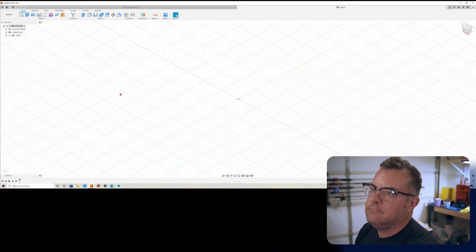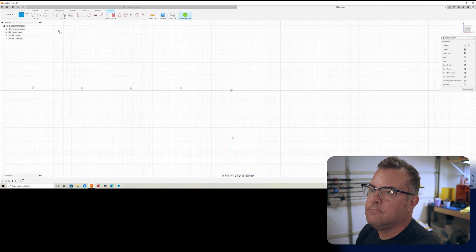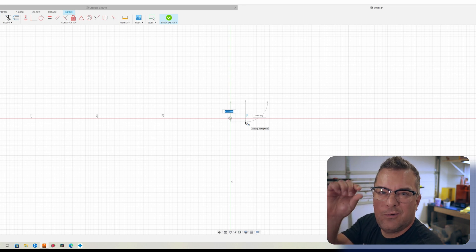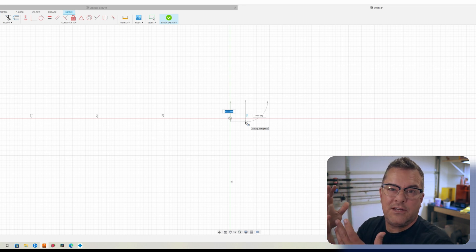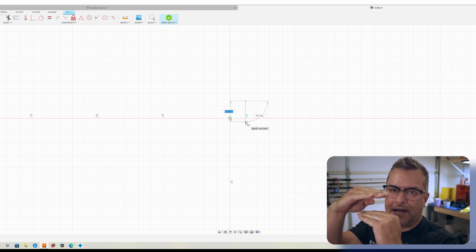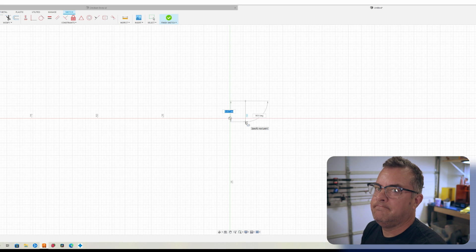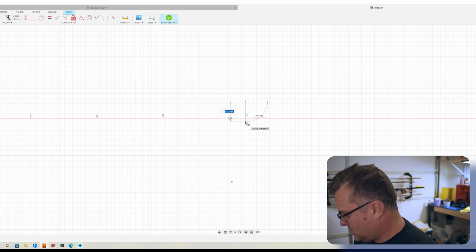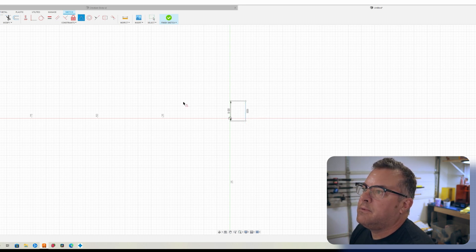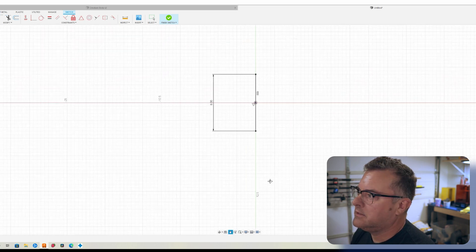Now what we want to do is draw our first head section. I'm going to start with the line tool, draw it over here and put it in the right spot in a second. This is how tall you want the lure to be. Rage crawl and most crawl slash creature style baits are kind of flatter and skinnier on top and get wider as you go down. Let's make it eight — we'll do a midpoint constraint on this line to the center circle.